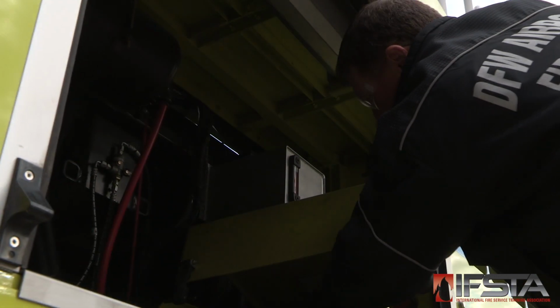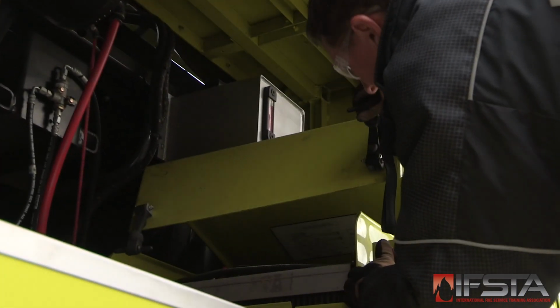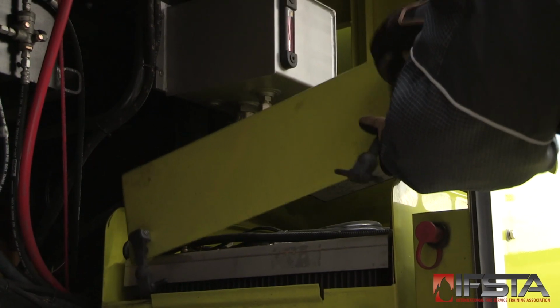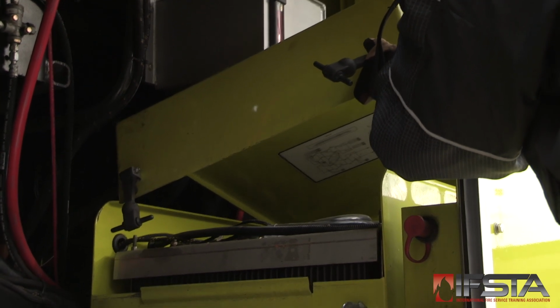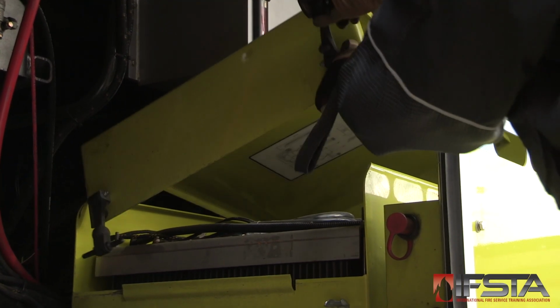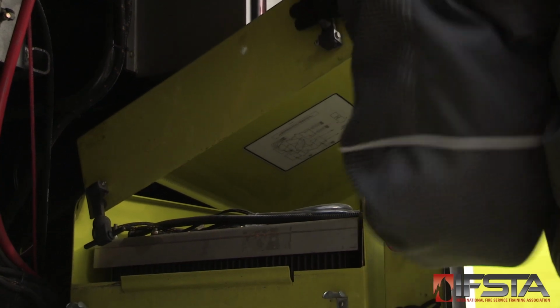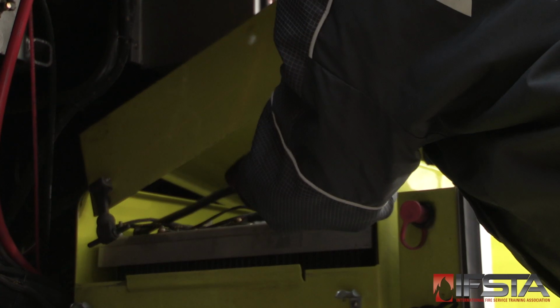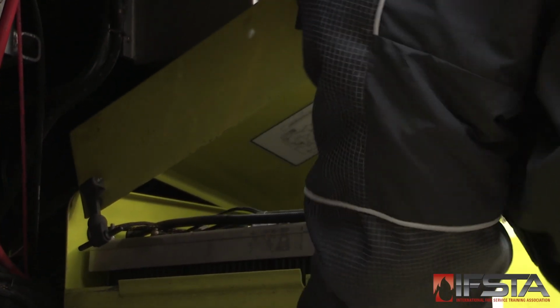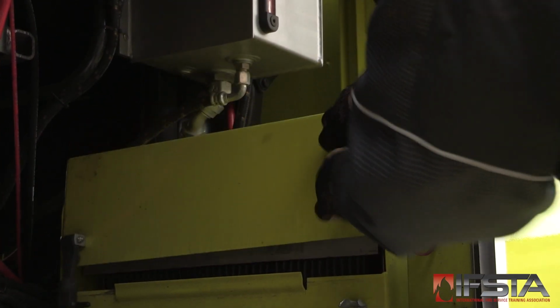Clean away any corrosion around terminals with a mixture of baking soda and water poured on the connections, scrubbed with a wire brush, and rinsed with clear water. If the batteries are washed, dry the batteries to prevent parasitic current. Clean road debris, dirt, dust, and moisture from the top of the batteries to prevent any bleed of current from terminal to terminal that can result in electronics issues.